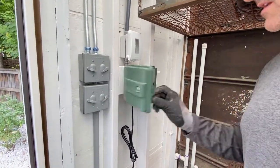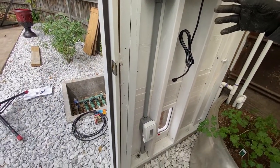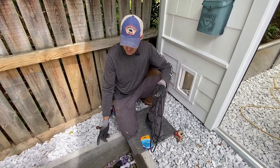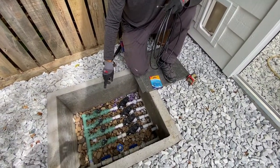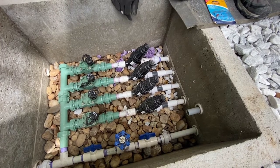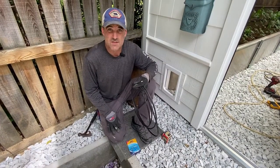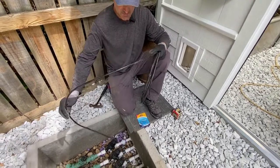Now that we have the Orbit 4 Station timer installed, we're going to go ahead and run the conductor wire down to our valves. I've got a scrap piece of 10-conductor irrigation wire. I don't need 10 conductor for this because I've only got four valves — I do have some extra wires for future expansion. Since we've got four valves, we only need five wires, so a five-conductor wire would operate all four valves. I have a conduit that runs through this irrigation box into the greenhouse. If you're interested in how we built this irrigation box, we have a separate video — the link will be in the description. I'm going to start running this cable through the conduit.